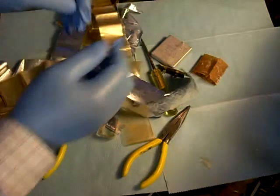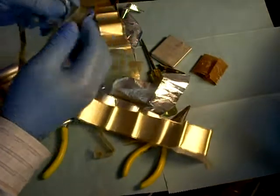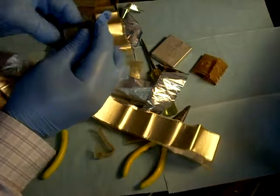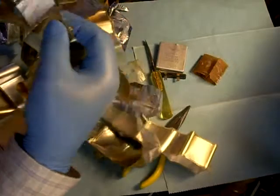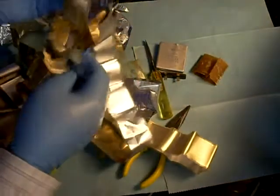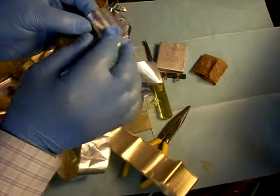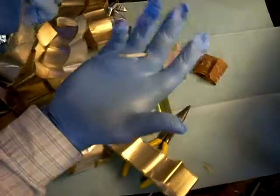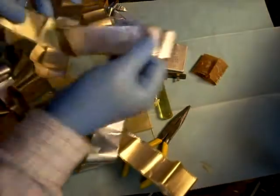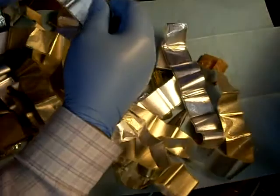I would suspect there's probably a few dozen square feet of foil here. I'm going to unravel it, hopefully to show the way the connections are made. We're down to about two thirds of the original size, so we're getting there. I'm separating the two foils. We've lost one of the strips — there's one of the connection strips; the other one fell out over here. The connection strips are literally copper tags, I think they're copper, that the lead-out wires were soldered to. They were embedded between the layers of paper and foil to make a connection to each layer.